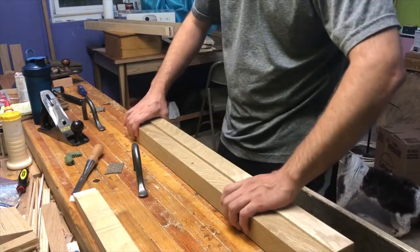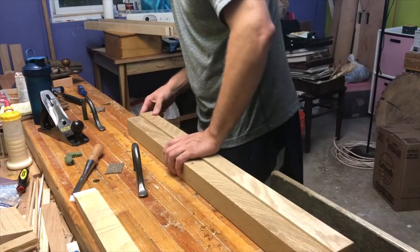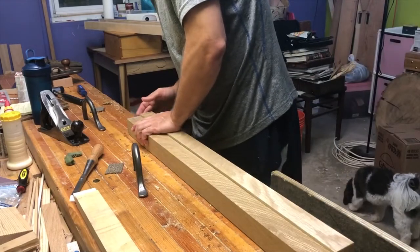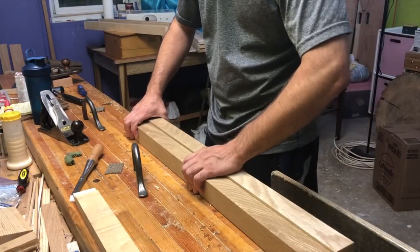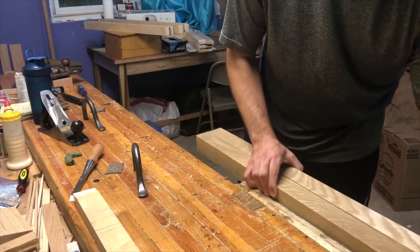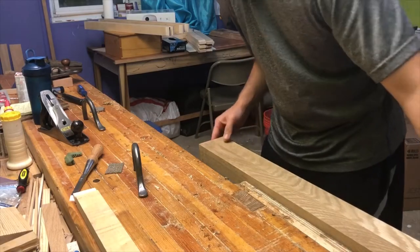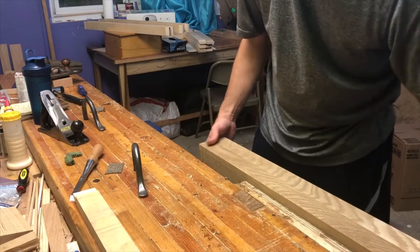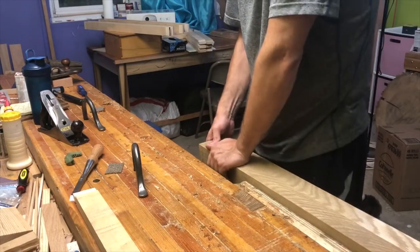All right, I got the bottoms marked on these. I don't know how well you can see it, but there's about an eighth of an inch difference in length. So square up the bottoms, make sure that they're flat and level and true. You can probably see they're not the same width either, which is just the way it works sometimes. Put it in the old vise here. All this other stuff doesn't really matter that much. I can work around the difference in lengths, difference in widths, and all those kinds of things, and still get everything square. I'm just going to have to know where to target.